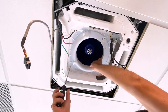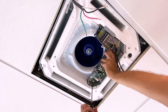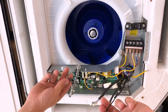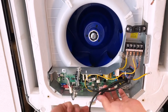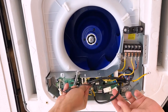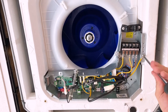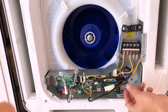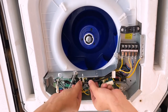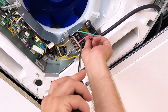Replace the inner panel and main board. Replace the evaporator temperature sensor, the water level sensor, the fan motor, and the drain pump. Then reconnect the ground wire and clip all the wires back into place. Next, you can reference your wire connections photo and reconnect the wires in the same order.